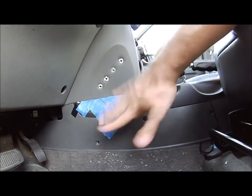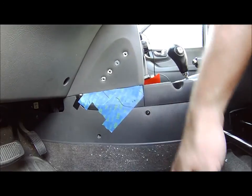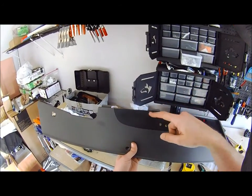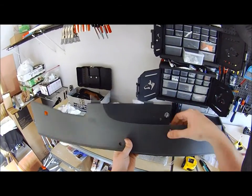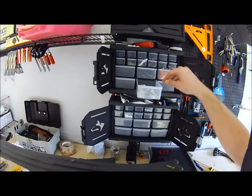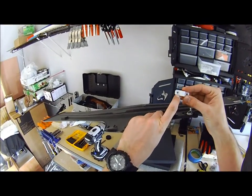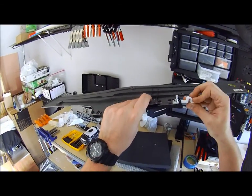This area kind of curves inward right here, so if I can space it out just a little bit that'll give me plenty of room to grab behind. This is the bottom piece of plastic I'm going through — my gun sits this way, trigger guard's right here. I've got a hollow wall anchor already in place. I fashioned a little piece of plastic from one of these anchor bodies, drilled through it to make it bigger to fit over the anchor, then clipped off the arch just to get a thickness of plastic back there.